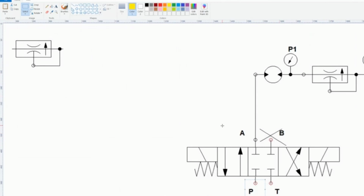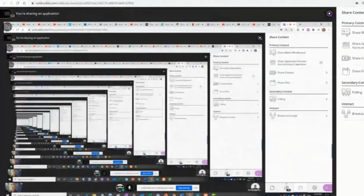But you may ask, well, why does the pressure change? Well, in hydraulic systems, the pump itself only has some power in it. And if this motor has to run at the same speed all the time, and I have some other process coming on and off, the pressure coming out of that pump or the pressure in the entire system may fluctuate a little bit, may go up and may go down. And that's going to change the speed of the motor. You don't want that. So it manages fluctuation.